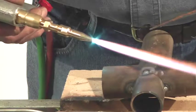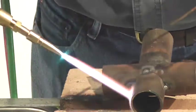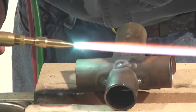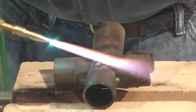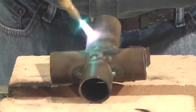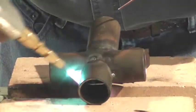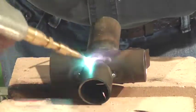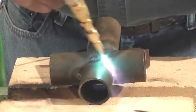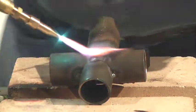It's always good to preheat and post-heat, but 063 and under is not as critical. For chrome moly tubing, you always want to preheat at least 300 degrees — especially for cluster joints where you've got tubing inside of another tube, or rosette welds. Always preheat at least 300 degrees on chrome moly tubing, and you want to preheat, post-heat, and stress-relieve it.